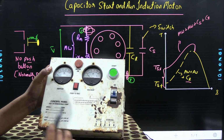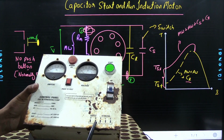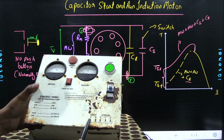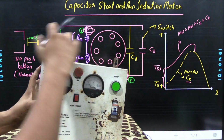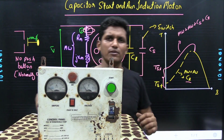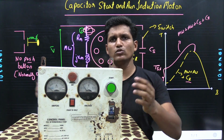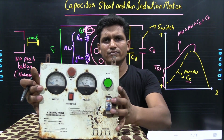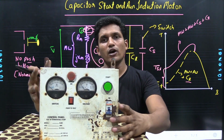Now there are two terminals from the supply, phase and neutral, and 3 terminals are provided to the motor: R, Y, B. If it is a single phase submersible pump, then why are 3 terminals provided? It should be a 3 phase motor if 3 terminals are provided. No.